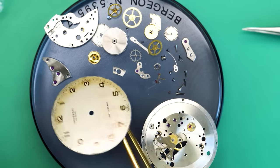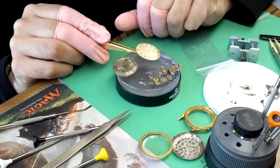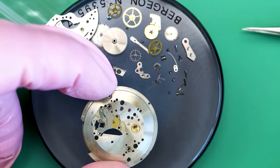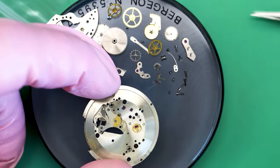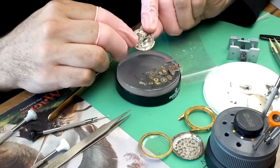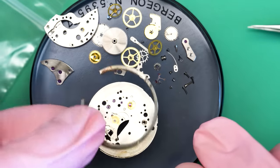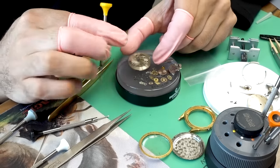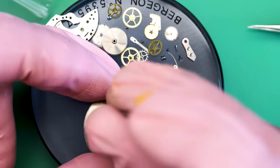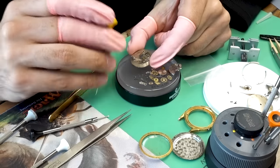It looks like it took the cannon pinion and the hour wheel with it, but that's fine. I can separate those out and take a look at the dial. I really like this style — it's got some patina on it, it's a vintage watch, but it looks nice. I think I'm going to give it a little bit of love, maybe clean it up just a little bit. Now we can look at the parts underneath on the dial side. That's the center wheel finally coming out, and there's this ring around the outside that looks to be missing a part. Three quarters of that ring should provide the same support, so I think we're fine.